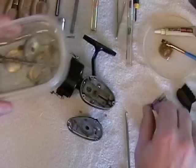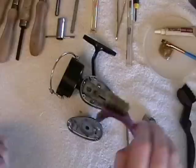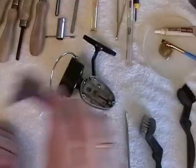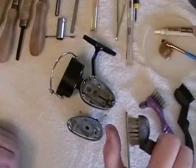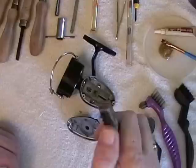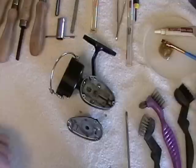Have these soak for at least an hour or two. When they're ready for cleaning — I'm not going to show you the whole process — you just have to clean them. Use a soft bristle brush; a regular toothbrush works. If you have any crystallization of the grease, you might need to go to a copper brush to get in between the gear teeth. Do not use any stainless steel wire brushes — they can do damage.